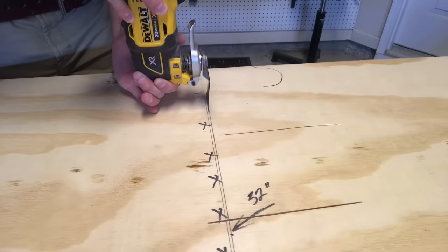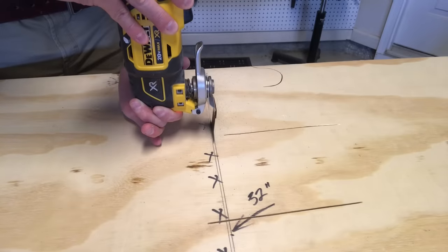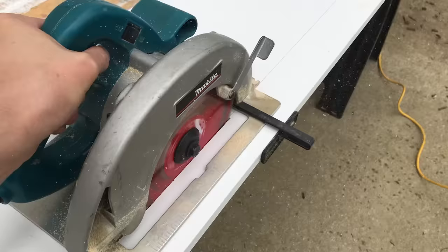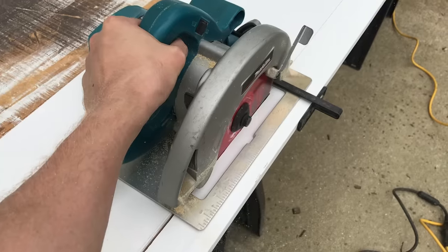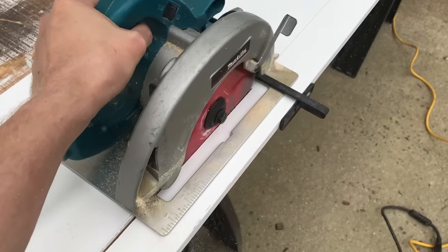Two: it's not great for long cuts. Because of its narrow sweep, it's one of the least effective tools for long pass cuts on wood. It can be done, but you're way better off using a circular saw or even a jigsaw for any cut over maybe 12 inches, because they cut faster and with far more power and stability. Save multi-tools for the smaller notches and plunge cuts.